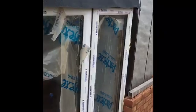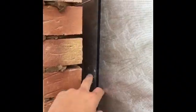An excellent example of the DPC coming up — the DPC comes over the top keeping everything dry. The brickies have filled that up through, and you can see they've tied it in all the way on the openings. What we're looking for is a nice clear cavity.